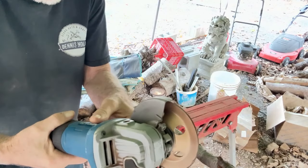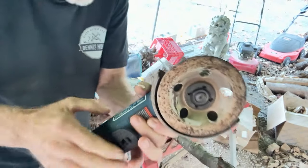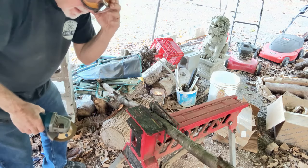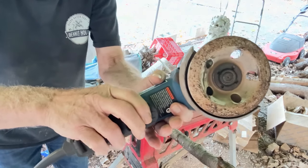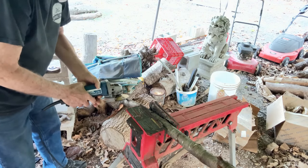I have my angle grinder with an aggressive wheel on it — it's got some rough grit. I'm going to go ahead and get this down from the tip and turn it around; I won't go all the way to the top. I have goggles on, and this model has a safety feature where you pull the switch down and when you let go it turns off. Don't forget to wear your goggles — not safety glasses, but goggles — these chips are going all over the place. Safety goggles are the important tip of the day.